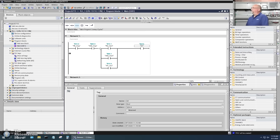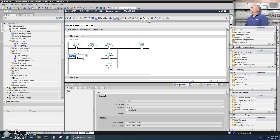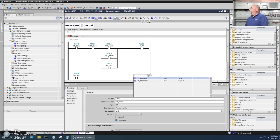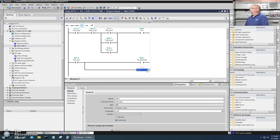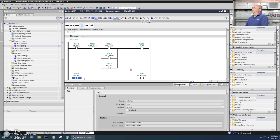The other thing I want to do is: when the contactor is on, turn on the pilot light running; and when it's off, turn on the stop light. So when the auxiliary is on, I'm running; when it's off, I'm stopped. That's a very simple application — let's go ahead and download it.